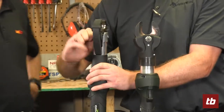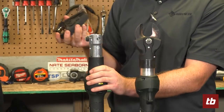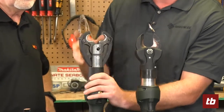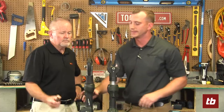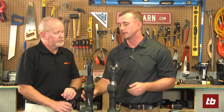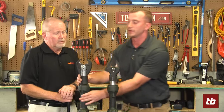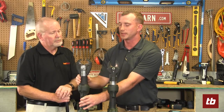Tell me about this one. So this is our EK 425. We've got different jaws depending on the type of presses you're using, so it's easy to switch back and forth depending on the crimp style that you need. You just switch back and forth, slide it in, pop — ready to go. Just spring loaded. All of our battery tools run off of hydraulic press, same structure just depending on what you need: cutter to cut, crimper to crimp. Cycle speed is the same. There's also a 350-degree rotating head — if you've got a tight spot and your arms are in an awkward position, you can rotate that tool so you don't have to fight to get into that tight spot.